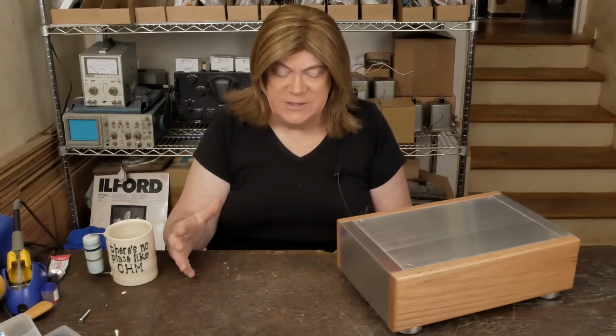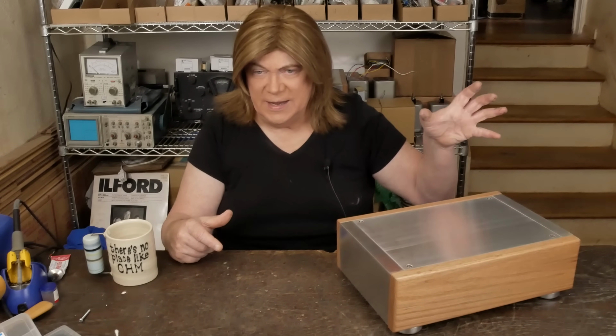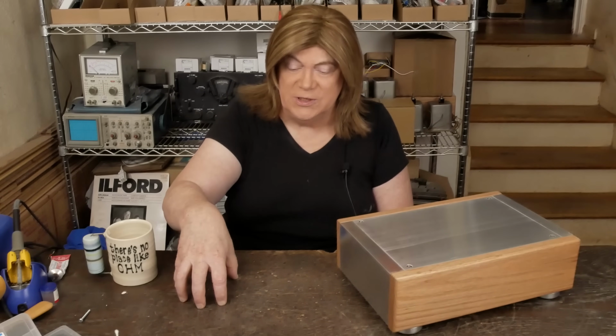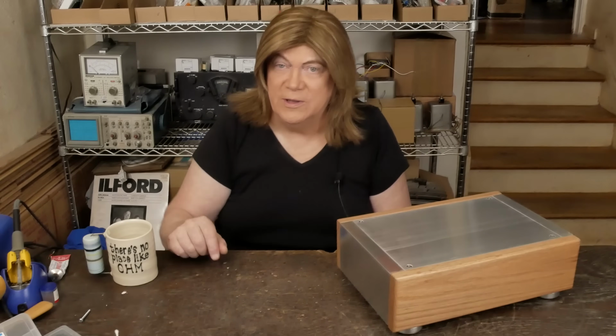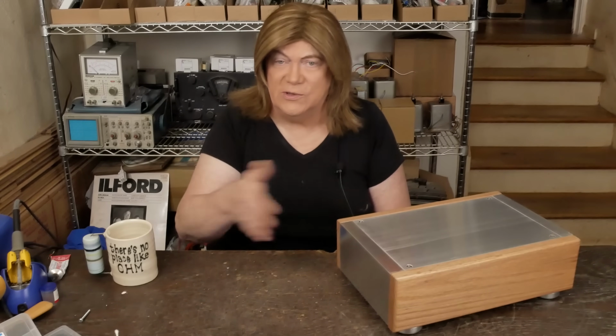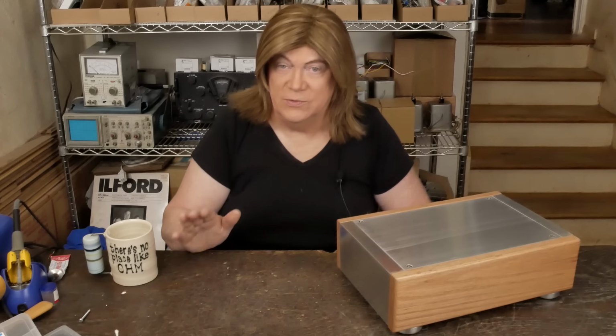So I'm thinking about doing a 300B monoblock. And one of the reasons in the past that I haven't really gone down that route was the expense of buying double the power transformers and double the chokes and all that stuff. And if you go with off-the-shelf stuff from Hammond, most of it is designed for a stereo amp. Once you get to a certain voltage level that you'd be able to power a 300B off of, to get to the 400 volts or 360, 370 volts across the tube, and to get to even 360 volts you've got to take the cathode voltage off, because I'm not doing a fixed bias or an adjustable bias 300B amp.